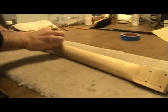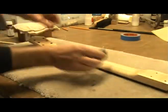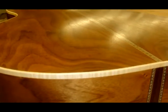I prefer to use steel wool to rub the finish out to a satin sheen, but you could also leave it glossy. Another product that is very similar to True Oil is Wipe On Poly. You can make your own or purchase a commercially made brand. Apply it in the same manner, and if done properly, you have a very appealing finish for your guitar.